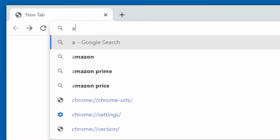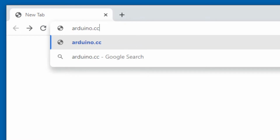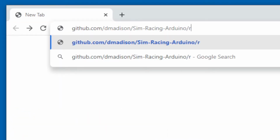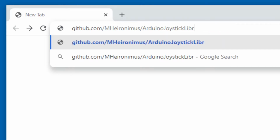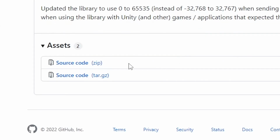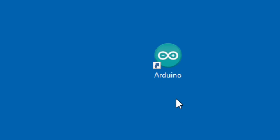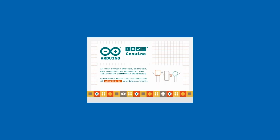In your web browser, go to arduino.cc and then download and install the Arduino IDE. You'll also need to download two libraries, the Sim Racing Library and the Joystick Library. Both links are in the description. Download the source code zip file for both. Open up the Arduino IDE.